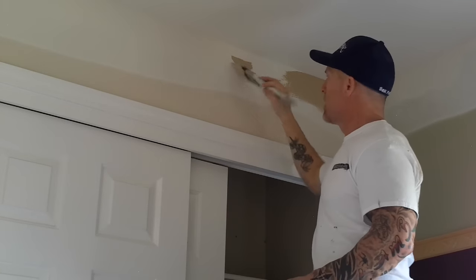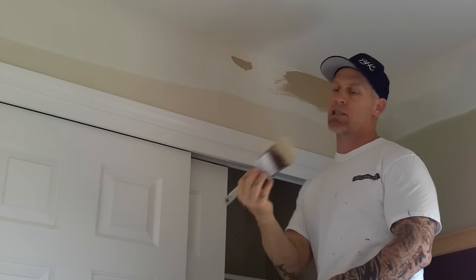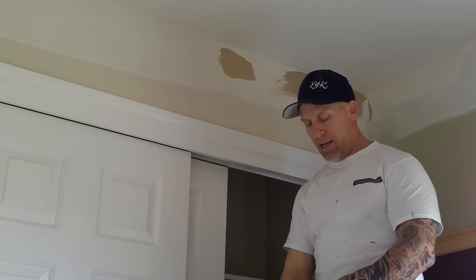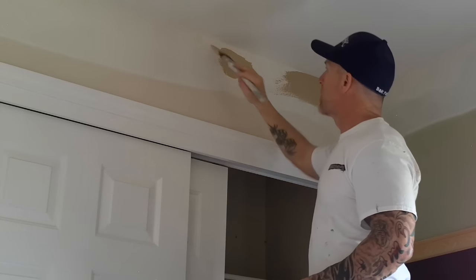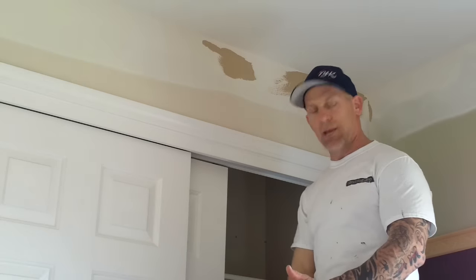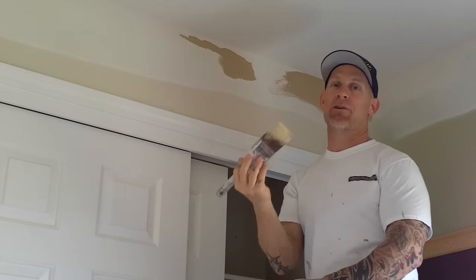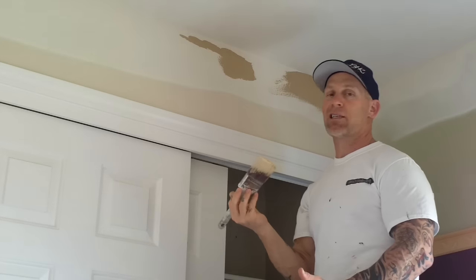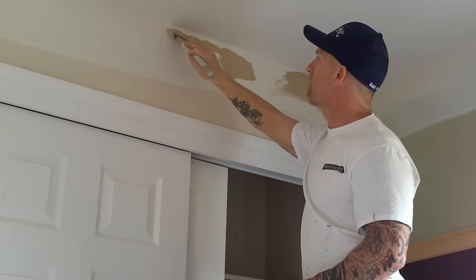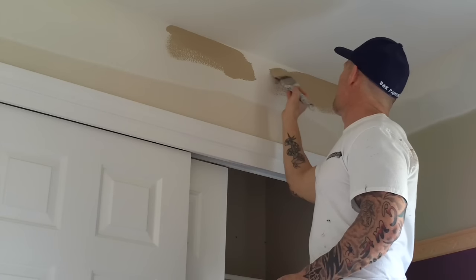I'm doing my cut-ins here using an extremely stiff brush — the stiffest brush I can find for this type of thick paint we're using — which is a Sherwin-Williams contractor's brush. It's a two-and-a-half-inch angled sash brush, and so much of getting a straight cut-in line is determined by whether you're choosing the right brush. If you choose a brush that's too stiff for the paint, it's not going to lay the paint out properly — it's going to leave a lot of roping marks and light spots, so highs and lows if the brush is too stiff. You as a painter have to determine the type of paint you're using and use the proper brush. You can use an all-around brush that'll work for most paints, like Purdy has an XL Glide brush that's really good for most paints. But when we're using this paint right here, Treasure Valley Eggshell, I like a really stiff brush.